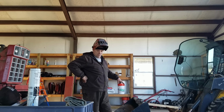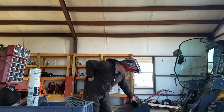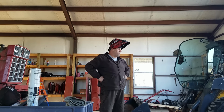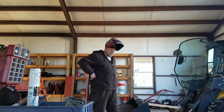I'm gonna try this one out. Make sure. But, it penetrated. I'm gonna do another run on that and just lay another one over it and get back behind this hook a little bit because I know that's the pressure point on it. Get back in there a little bit more and hopefully that'll be good. I've got another hook the same size on the other side.